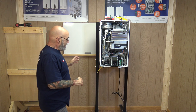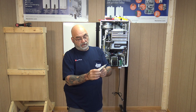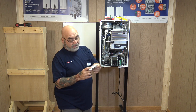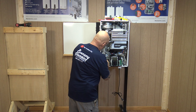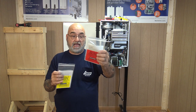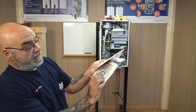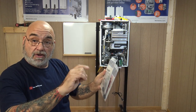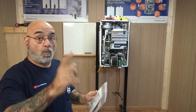With Navien they give you some extra parts next to the PC board: o-rings, a fuse, a plate for the flame rod and sensor, sandpaper to clean the flame rod and sensor. They give you both the propane and high-altitude natural gas kit. Each kit contains an orifice, extra screws, extra o-rings, a figure-eight and an oval o-ring, and a sticker to affix to the side stating you converted it from natural to propane — including the date and who did it.